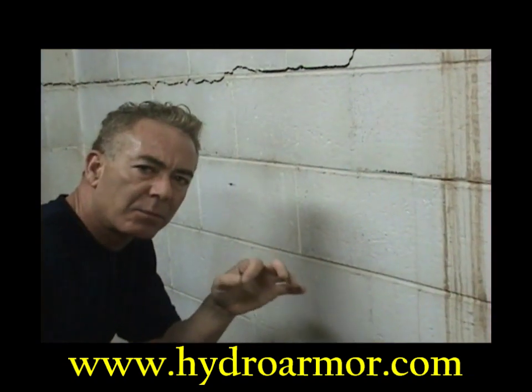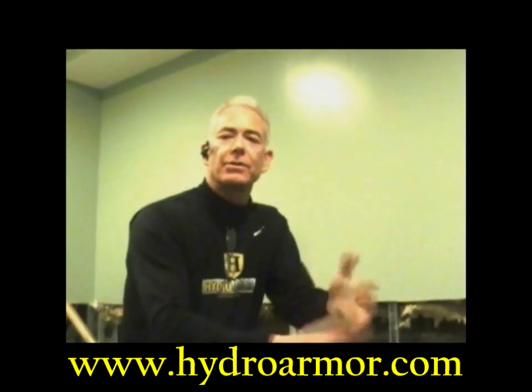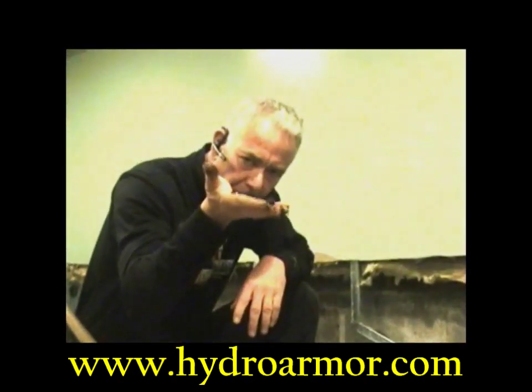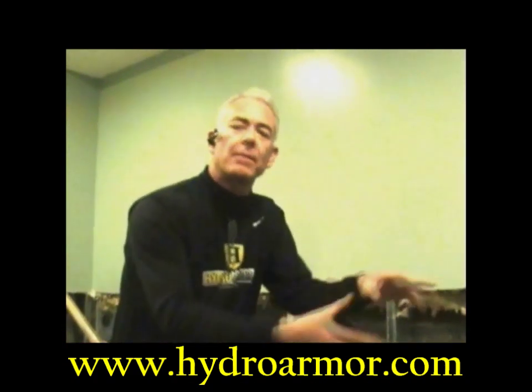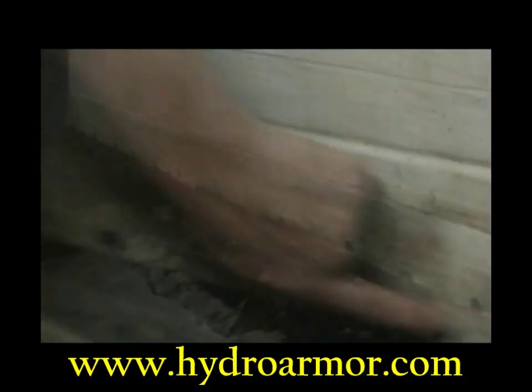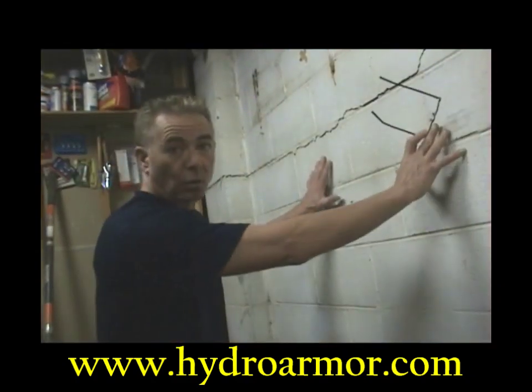I can't say enough how important it is — water pulls the bottom block right out when water sits at the bottom of blocks for too long. This is cinder block. This is what happens when water sits at the bottom of blocks for too long. There's no weep hole on the mortar joint — they missed this one, and this one. Every weep hole has to be drilled, especially when you've got a wall that's moving.